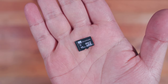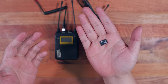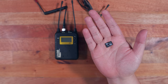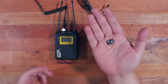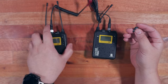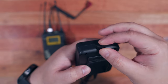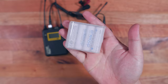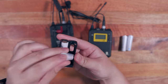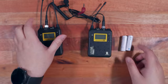You can insert a microSD card for audio recording backup, but what I found out is that you have to enable the recording mode inside the menu and make sure the recording icon is visible on the LCD display. It also doesn't sync up with your camera, so you have to manually disable the recording inside the menu, otherwise it will just continue recording — a slight hassle, but I can live with that as long as I have a backup. Both the transmitter and receiver are powered by two AA batteries which, depending on the battery, can last ideally up to 5 hours, which should be substantial enough for any type of video recording, even for live streaming.